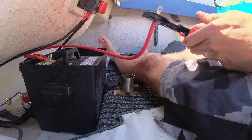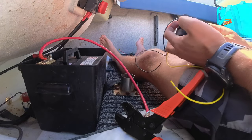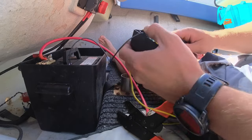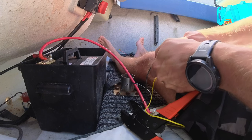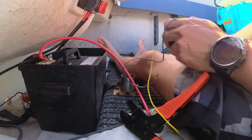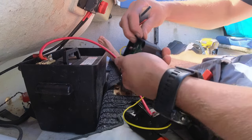The cable is going to go up so the flat edge of the crimp wants to be facing that way so it goes in nice and neat. I'm going to the bottom of this isolator so I'm just going to knock these cable glands out — just chop them on the sides with a blade then you can crack them off and finish it off with the edge of the blade.